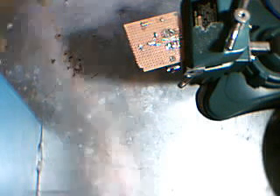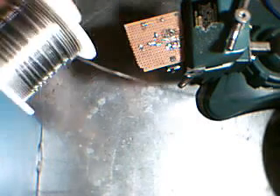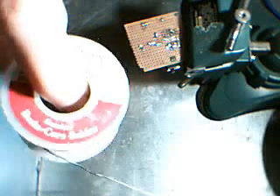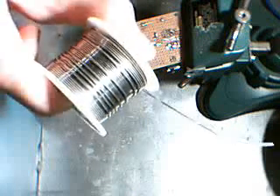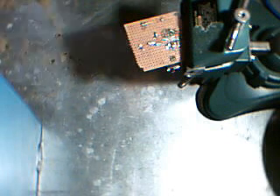There are a couple of things you need to start soldering. First is obviously a soldering iron. You can get one for as cheap as $10. I recommend a good one with a base and a little sponge to wipe your iron tip off — a damp sponge, because if you do it with a dry sponge it will burn. Another necessary thing is obviously solder. They sell really small amounts for a couple of bucks — about $5 or $10. Solder is probably the cheapest part of soldering.